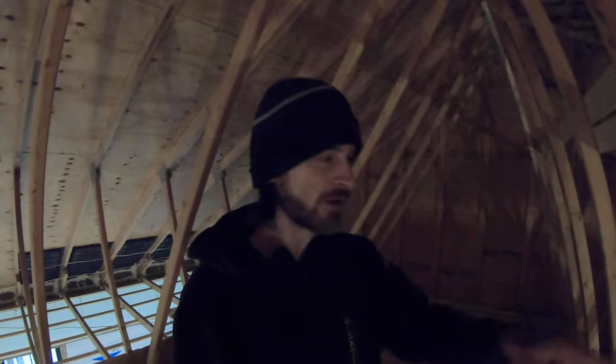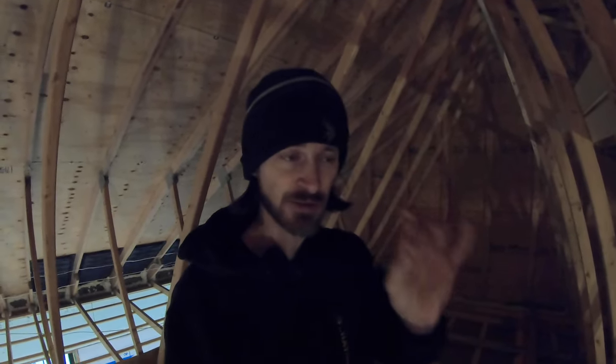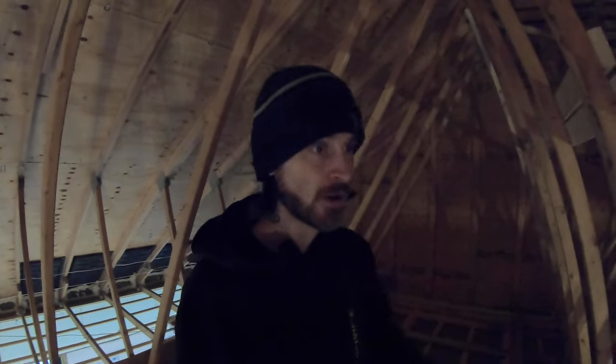But you'd still have to worry about in between your walls and stuff, because I don't think they're putting the vapor barrier underneath of walls, or they're just running it right up to a wall and cutting it, and then drywall's coming up into there. And then again, you're relying on the mud to actually seal the drywall, but you're still worried about the cavity space down in between that I would just personally air seal with the spray foam. But again, that should drastically help.